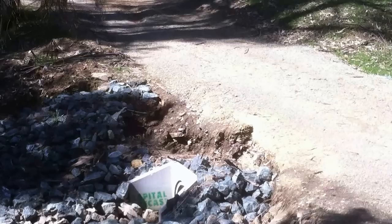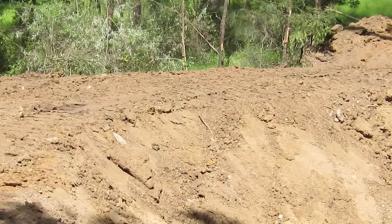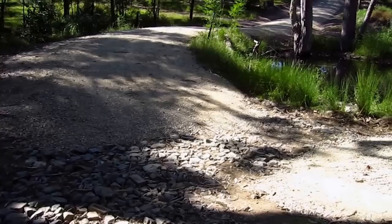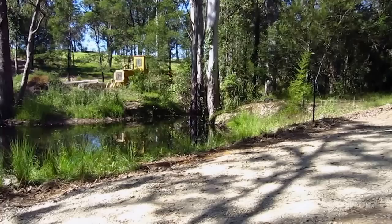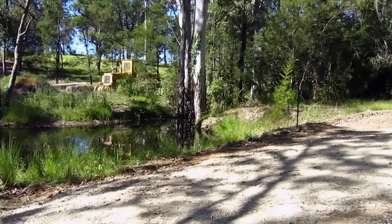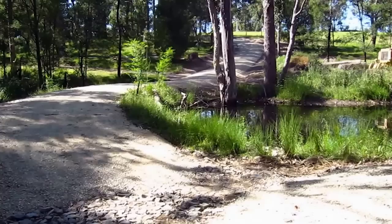Here at a little crossing dam. There was a 300mm pipe in this gully which continuously washed out and blocked access in big events. So we designed in a little crossing dam, which certainly turned the problem into the solution — giving all-weather access with a level seal causeway here, and creating a beautiful habitat for wildlife in this riparian zone. Because we've held moisture in the valley, it's actually switching from a dry valley with seasonal flow to a permanent water source and turning back to rainforest species. The local land care officers came out and said to the client, 'Do not touch this — this is absolutely fantastic.' And that's through good design by placing a little crossing dam.